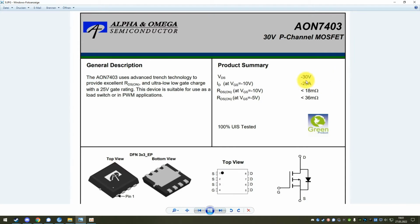So in this case you might end up using, I think, 5, 6 or 7 amps maximum. So this MOSFET can easily conduct that without getting warm, and that's the idea here. So when you replace it, choose one that has at least 30 volts drain source voltage rating and at least, let's say, 25, 30 amps continuous current rating, so that it will also have no problems conducting this current.